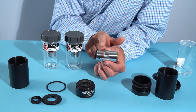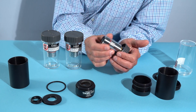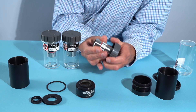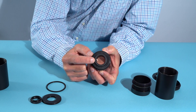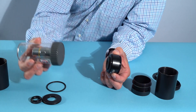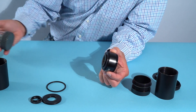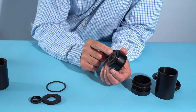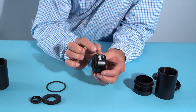We're going to put a lens tube here, so we've got lots of room to put filters, polarizers, or whatever we need. All of these objectives have pretty much the same working distance — somewhere around 30 millimeters. Keep them in cases if you're not using them, as we have to assemble the rest of the optics first. This is the tube lens, and what this lens does is focus the objective and bring it down to your image plane for your camera — typical for any microscope. These objectives are built for a 200 millimeter focal length.